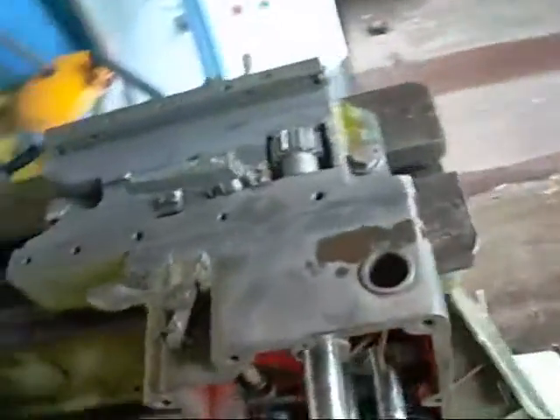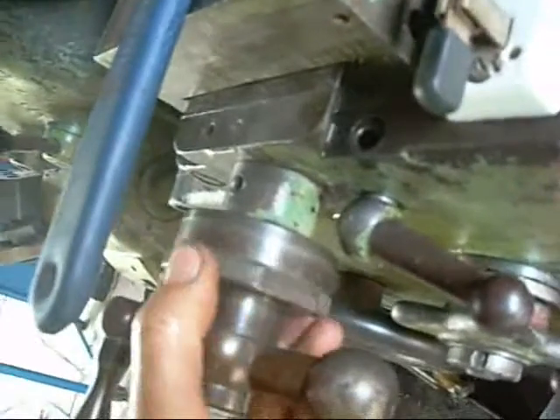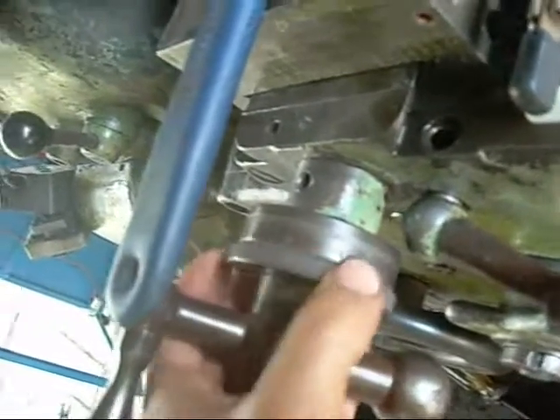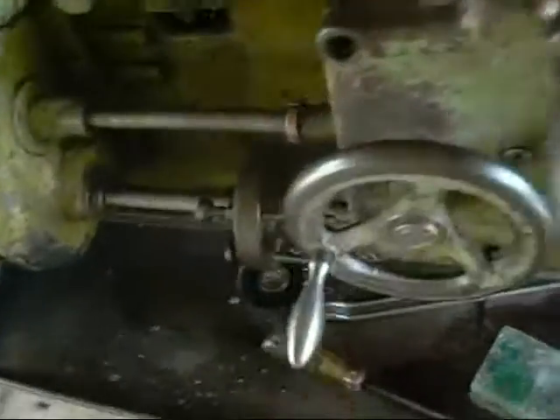I worked out that despite its age, most of the fasteners used on this lathe are metric. There are usually 8, 10, or 12mm bolts — like that's an 8mm bolt — and there's an 8mm bolt in the other end of this shaft, 10mm I think. Shaft diameters are all metric too: 4, 8, 12mm — could be thousandths. That might still be imperial, but the fasteners used to make this thing are actually metric.